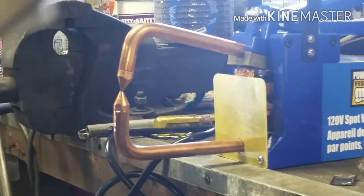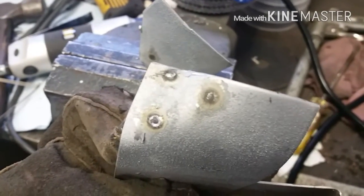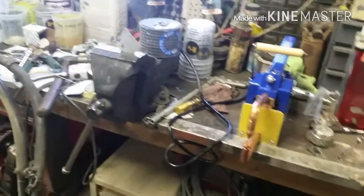That may be the road I'm going then — it lets me know that it gets sealed up inside. Here's the results: one of the spots did not penetrate at all. It got red hot and everything else, but it didn't actually stick together — but one did. I had to break that to get it apart. I'm not sure what the weld-through primer serves other than the areas around it, but it does allow it to conduct electricity through it, which you need for this to work. It sprays out kind of like stucco — it doesn't lay out like regular primer. I've heard there's a copper version that's supposed to be better; this is a zinc. So maybe I'll do a little exploring and see if I can find that somewhere.